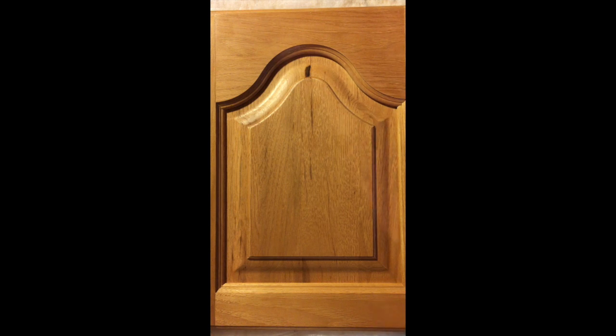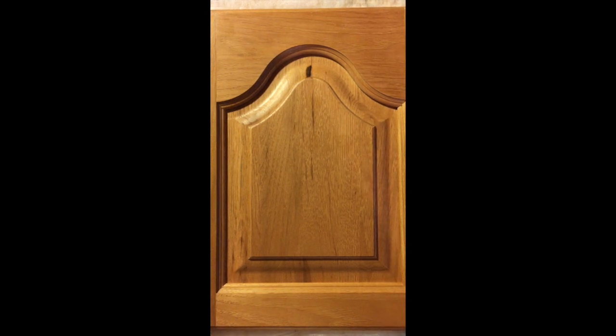So you will have your piece all painted, and these cabinets are going to be white. And you have to be really extra careful with white. But these can be painted and everything looks fine. But then after they're dry, you start seeing some yellowish streaks or spots, discoloration throughout the finish. And a lot of times the reason that happens is it's called bleed-through, and that means that the wood tannins are bleeding through your paint surface.